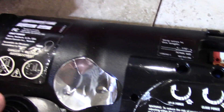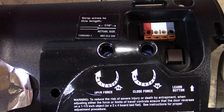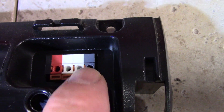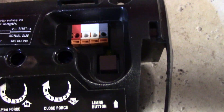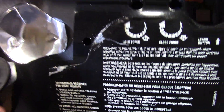Put in your four screws: the two machine screws go on the top corners and the two wood screws go on the bottom corners. Get those tight. Next, insert the wires that you labeled into the correct holes — you can use a very small screwdriver to push the tabs in to insert the wires.